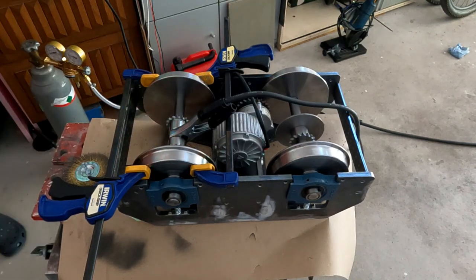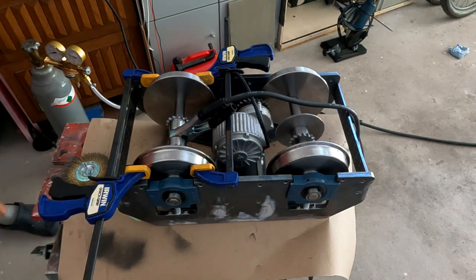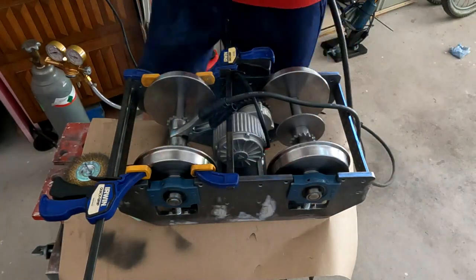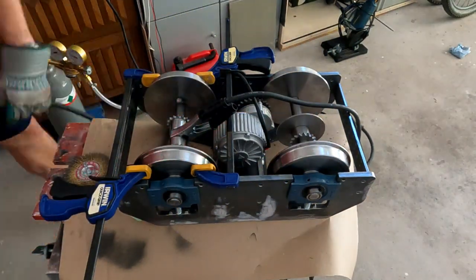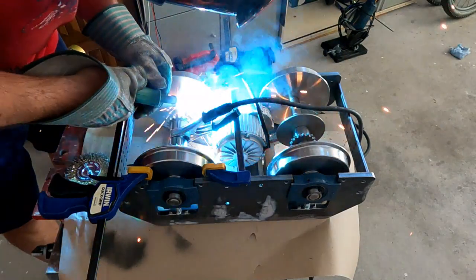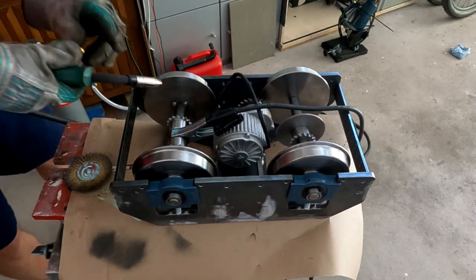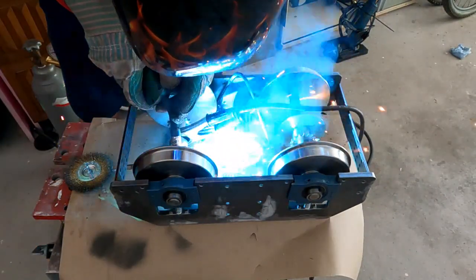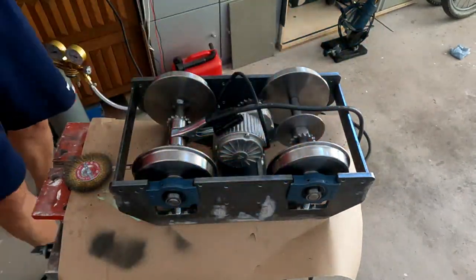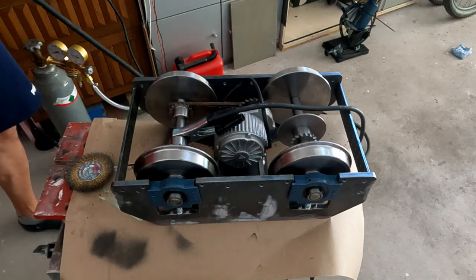On the axle that receives drive from the motor, I used a piece of metal to keep the sprocket aligned to the motor sprocket. On the other side — the sprocket that drives the other axle — I used a block for every single axle to keep the sprocket at the same distance from the wheel consistently. I used around 130 amps for 8 millimeter material. The documentation says 160 amps, but that puts unnecessarily huge beads. Since this is a loco and the wheels will just slip under excessive load, smaller beads are good enough.